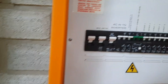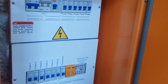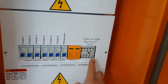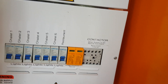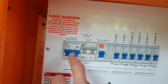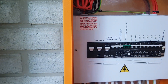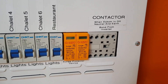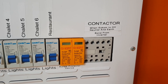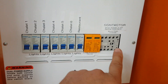Here we've got our inverter being powered from the main grid, and on this side we've got a little contactor for the inverter to make the earth-neutral bond. Here we've got our inverter isolator. I'm going to switch off the power from the grid - as soon as I do that we drop the grid and lose the earth-neutral bond, and this is what the contactor handles. You can see the contactor immediately switched and now the neutral is bonded to earth again - it's a safe installation.